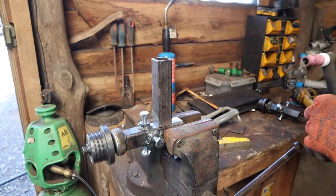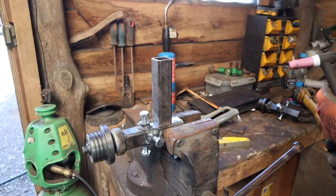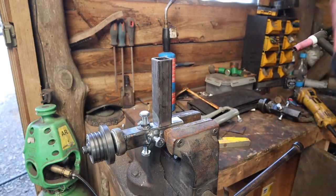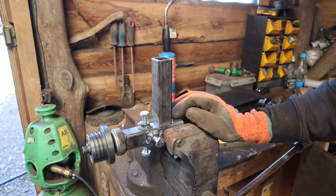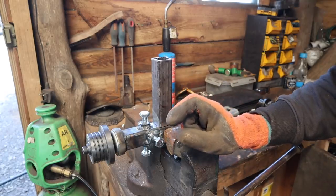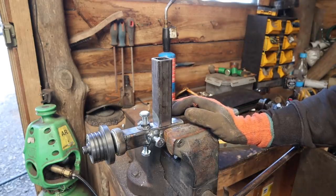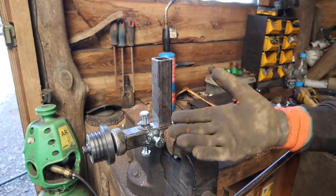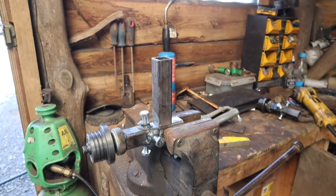So my feeling with this is that you do want lots of adjustments so you can get things tuned in, but you don't want so many potentially unnecessary ones that when you've got a problem you just don't know which adjustment it is. So I want to take out any adjustments if I can, and this is one I don't think I need in this situation because of the thin band wheels. The blade has to ride in one spot. I can't track it all over the place because it just goes where it goes. So I don't know why I need in and out unless I've changed the band size, which I'm not going to do because it wouldn't fit on the roller properly anyway. So yeah, we're going to go with this.